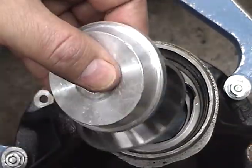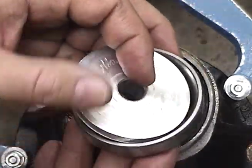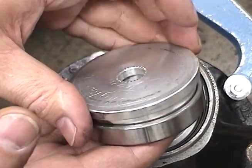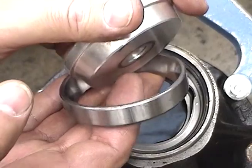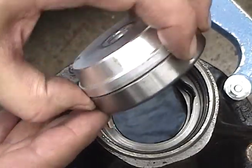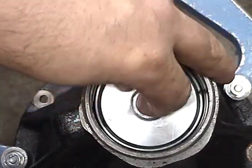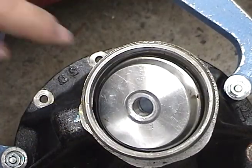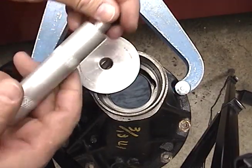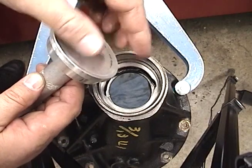They make bearing installation tools — this is a bearing installation cone right here. If you have the right size, it fits in there perfectly; this one does not. The very next size up I have is actually too large, so this universal tool doesn't fit properly. Flipping it over the other way does seem to fit pretty well. The other factor will be whether it drops down into the housing all the way — if it drops down inside, the outer diameter is not too big and it may put the race in just fine. This universal tool comes with a hand driver and we need to install it like so.